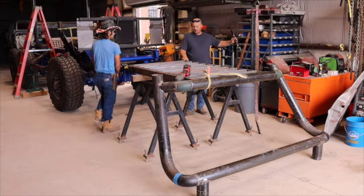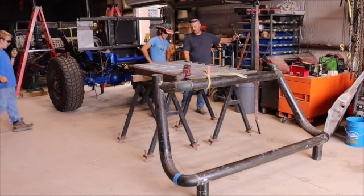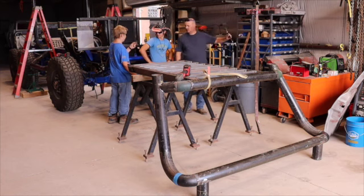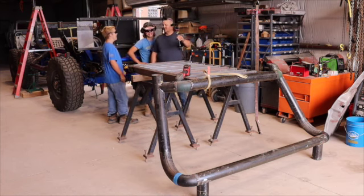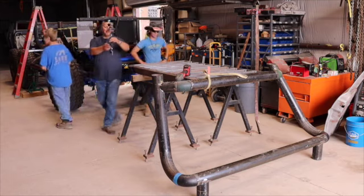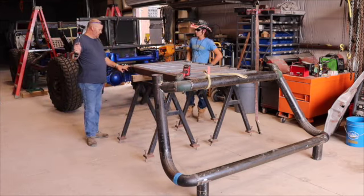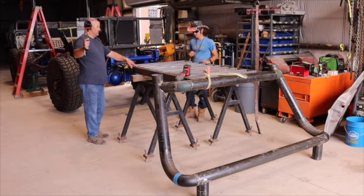We've got to cut these plates off, these outside ones. This one's still on — I cut the other one because of it and we had to cut out a little weld. So are we going to be using grinder, cutter, sanders? Yeah, we're going to use the grinder or the cutting wheel first because we want to make sure we don't compromise this steel.